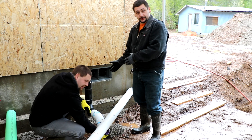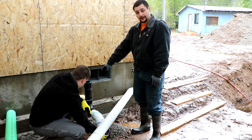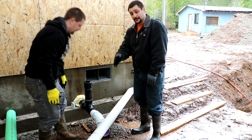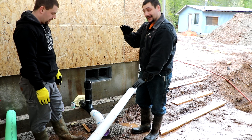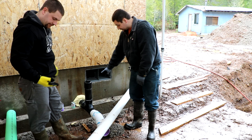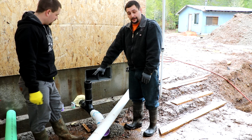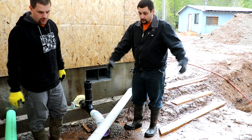These are things to consider when you're doing your foundation work — where the exit for your pipe is going to come out. We put it in this corner so we could come out of the house and kick underneath of this pipe. Sometimes if your foundation wall is high enough you can put the exit higher on the wall, but in this case the vents are high and the backfill and dirt will come up here, so we just go 45 underneath it and then tie into the tanks.